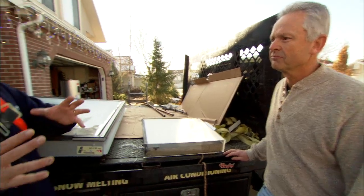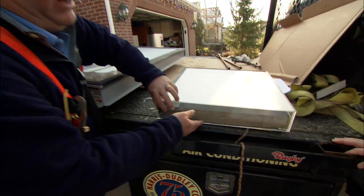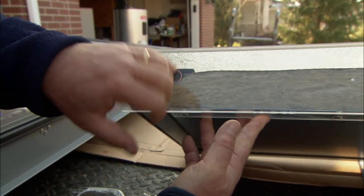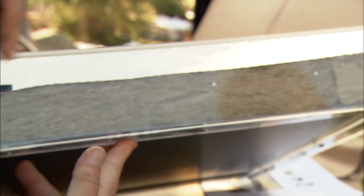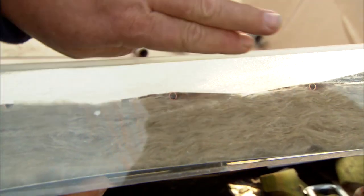It's going to help in the freeze in the winter, but also in the summer, this liquid gets so hot that if it were just plain water it could turn to steam. This is a cutaway of the inside of a solar collector. There's a header right here — a copper pipe — that's where the antifreeze is going to pass through. There's a copper sheet with a special coating on the top, and below it is insulation. When the sun hits that collector sheet, it's going to heat up that liquid. You can also see there are small tubes that are going to pass through the collector.